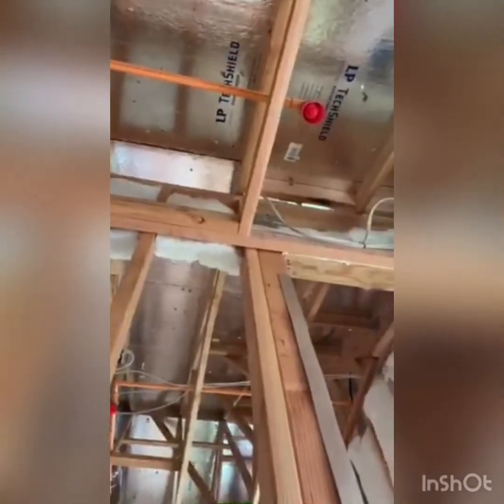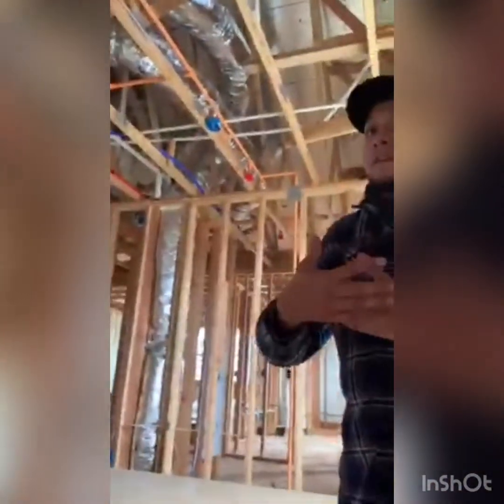It needs to be fully covered on this knee wall. And when you're coming up the stairs, this is a knee wall, so all this — like this side where the attic space is — it needs to have plastic. What that does is give the insulation six-sided contact. This side is obviously going to have drywall, but on the other side it needs to have something giving that six-sided contact for the insulation.